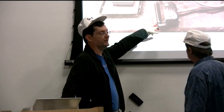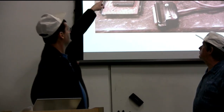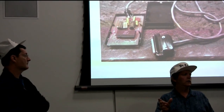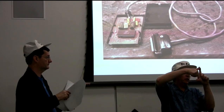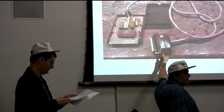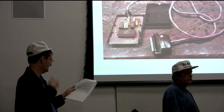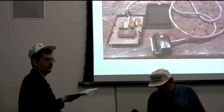The prototype has a 25-pin RS-232 cable hardwired in, whereas later we put a female DB9 on the cartridge. The IBM PC was the one who said there are 25 pins, but we're going to go down to the nine essentials - they created the DB9 as the new-shape RS-232, which we adopted for our cartridge. We tried to use a competitor chip by Cypress, touted as 100% compatible - a knockoff of the cool, expensive MAX232 with the charge pump. It was so much cheaper.